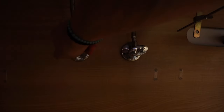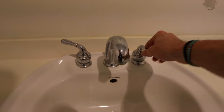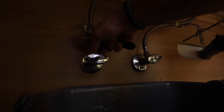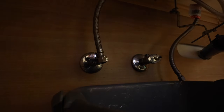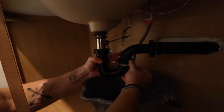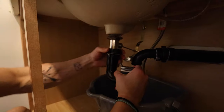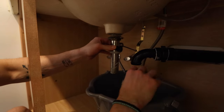Next, I made sure to turn off the hot and cold water valves underneath the sink. I tested the water to make sure it was off. Then it was time to start detaching the lines — make sure you have a bucket underneath for any residual water. Loosen the nuts with a wrench and then unscrew by hand. Next, I unscrewed each piece on the P-trap. Once again, make sure you have a bucket underneath because there will be water in it and it will be gross.